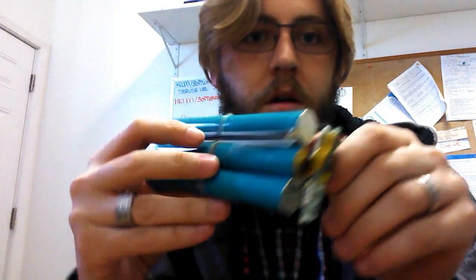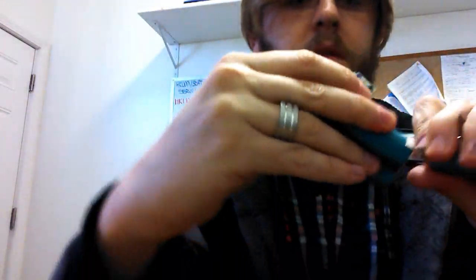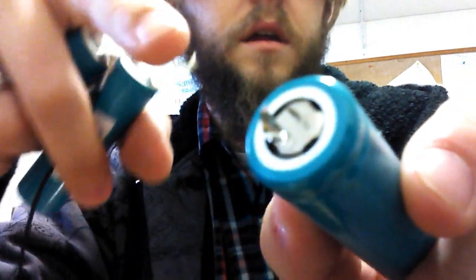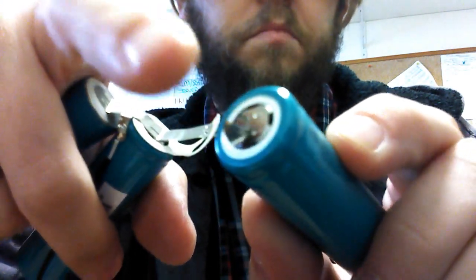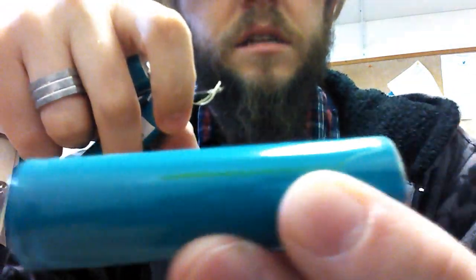The back jacket came off, no problem. I have six more batteries. I'll simply bend the end off, take the circuit boards away, and break the contacts because they're all soldered together, as you can see here. Just pull it apart. I'll take a little needle nose and pull that pin off and flatten down these little contact points where it's welded or soldered together. And from there, that is an 18650 battery.